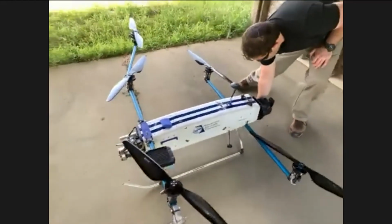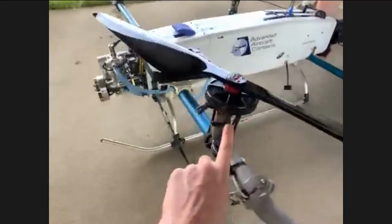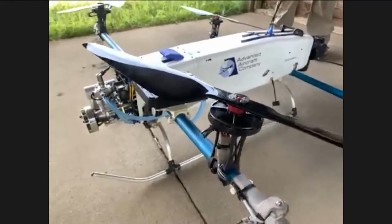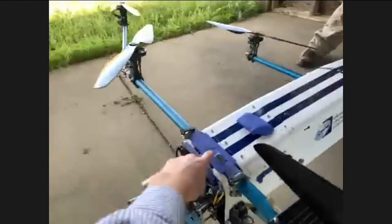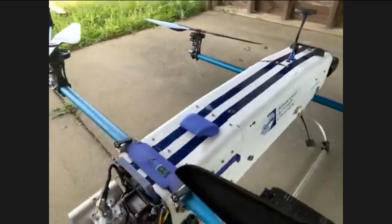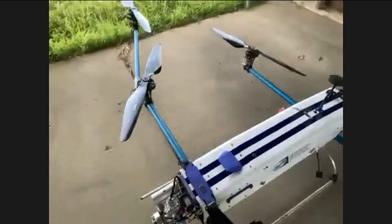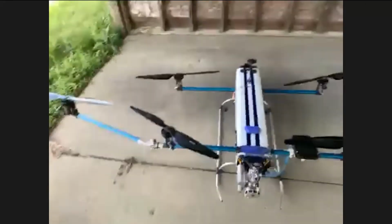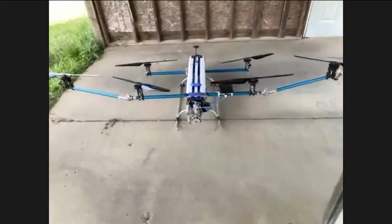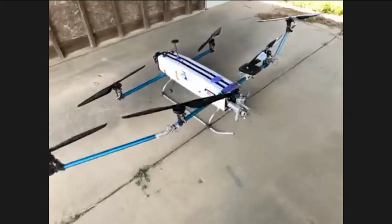The fuselage is pre-preg carbon fiber. And the motor mounts, these are 3D printed plastic. It's the Hewlett-Packard Multi Jet Fusion technology. These parts are not as much loaded. This is shapeways.com, versatile plastic. So depending on how the loads are on that component, we use different material technologies. That's whatever is the best value for that application. So every component has different materials it's made from.